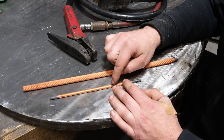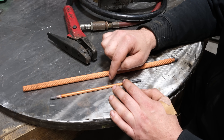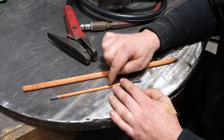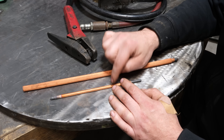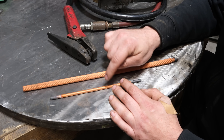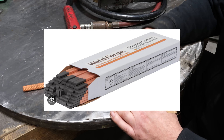This process requires a ton of power — later when I talk about the feasibility of doing this at home, you'll understand in a hurry where the problem is. To give you an idea, this quarter inch carbon I run at about 300 amps — and that's a quarter inch, which is considered an average to small size. This would be useful for a two or three pass weld to remove it on three-eighths plate. When you start getting into big welds, this is far too slow. Going up in carbon size really helps you get the job done faster. They do make these smaller — flat ones that can remove a strip of material.